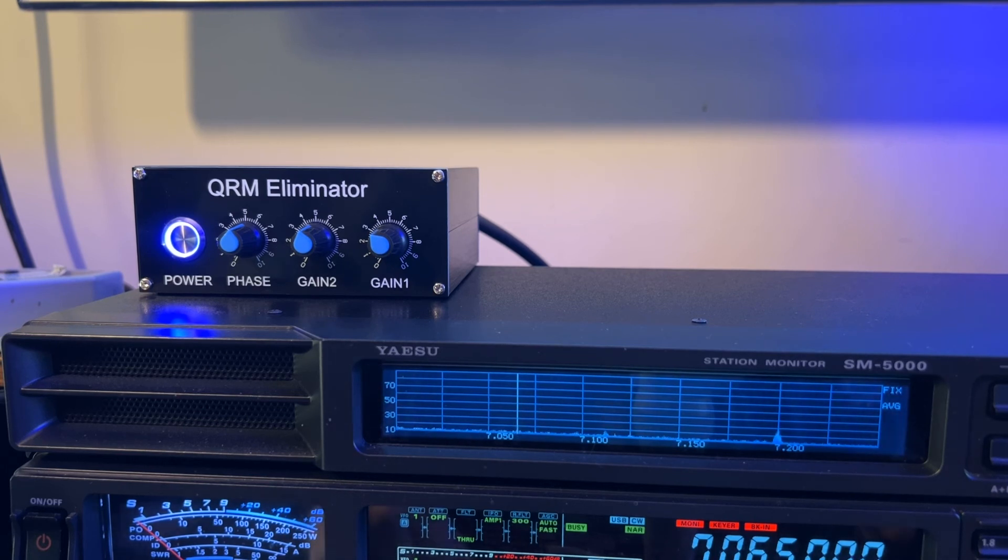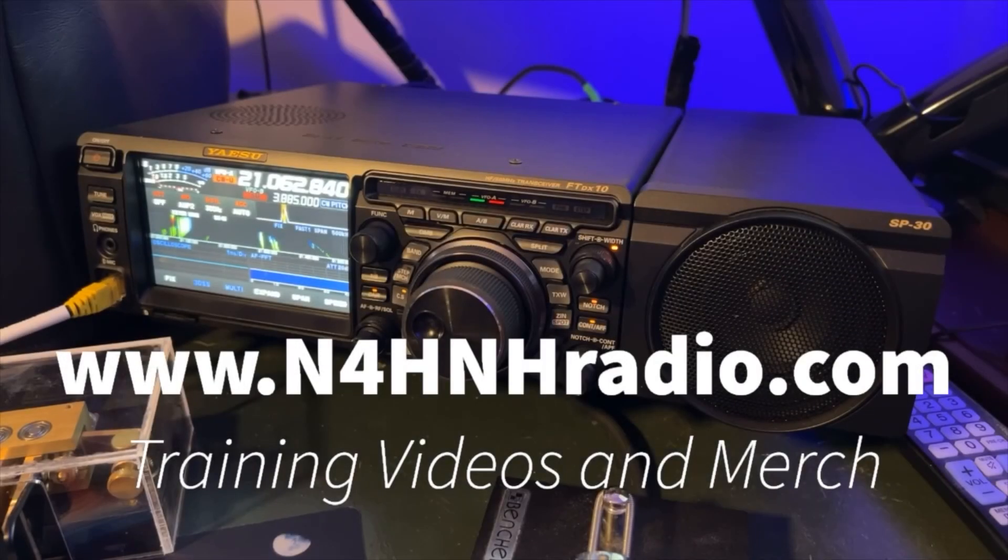If you are not using an amplifier and therefore not using the linear port, then you could buy a cable that has the 10-pin mini DIN wired to the transmit points on that connector with the other end having an RCA plug - I have one like that, I ordered it on eBay. Now if you are using your linear port but not your tuner port, then you could wire or find an 8-pin that also takes advantage of that transmit signal from the output of the radio and use that for your QRM eliminator. It just worked out for me that the foot switch was available, keeping the radio out of the equation.